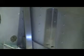And put that on there. Goes there. Make sure everything's right. That one goes there. It's got a 25 thousandths gap in between it. All right. Looks good. Now I'm going to go and rivet those in. And this piece will be done.